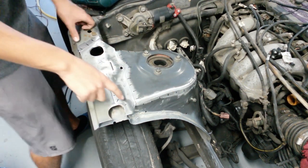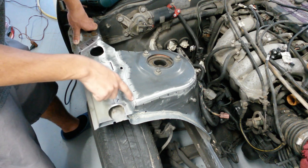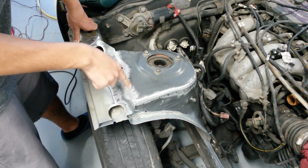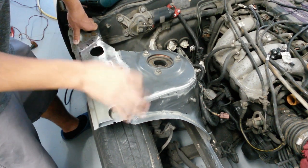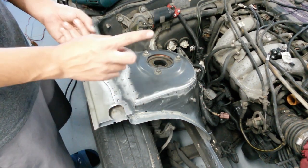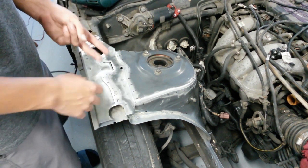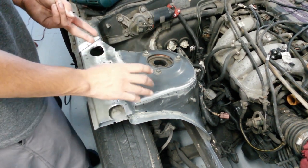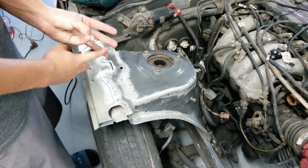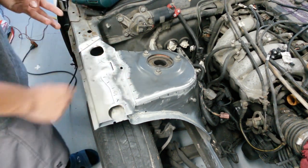Again, another benefit of just doing these spots of weld is you can just point the welder there, pull the trigger, and then weld it, and then move on to the next spot, and they will all look more or less very uniform with one another. So first one seems like it would have better load distribution. Second one, to avoid distortion as well as blowing through the sheet metal. And then the third one, which is for aesthetics.